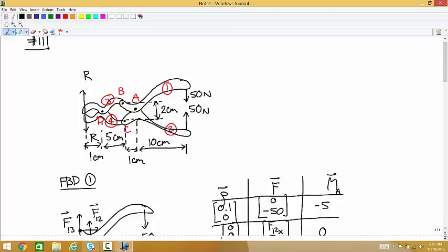If the mass was given, I don't think it would change it, actually, in this case. The only thing that makes this problem weird is that these plier things are floating in space. And so there's nothing restricting their rotation and translation. That's why we have three fewer variables than we're used to in a structures problem like this. In my solution that's posted online, I did something that added three more variables and made it like a structure that we're used to dealing with. But you can also just do it with fewer variables.